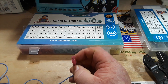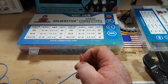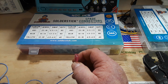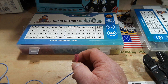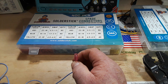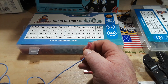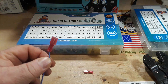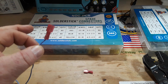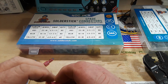What we're looking at are the standards from the NASA workmanship book — NASA Workmanship Standards, National Aeronautics and Space Administration, Johnson Space Center, Texas. Book number 2, section 2.01, revision date 3-30-2001. We're talking about soldering, tinning stranded wire or solid wire. According to NASA standard 8739.4, section 4.3.4, the crimping of solid wire component leads or stranded wire that has been soldered is prohibited — because solid core wire does not deform and transform the way stranded wire does.